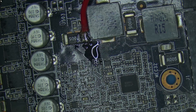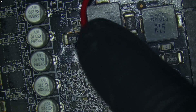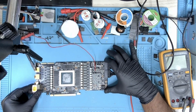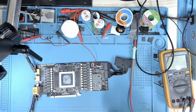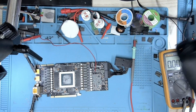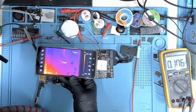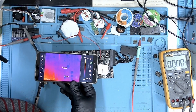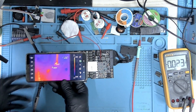Let's connect a wire. I've connected the jumper so that I can inject some voltage here. I'm going to inject 5 volts and 4.5 amps because there's nothing blown, so it may take a higher voltage than normal. Let's test it up — injecting voltage now. And I can see a MOSFET that's glowing.